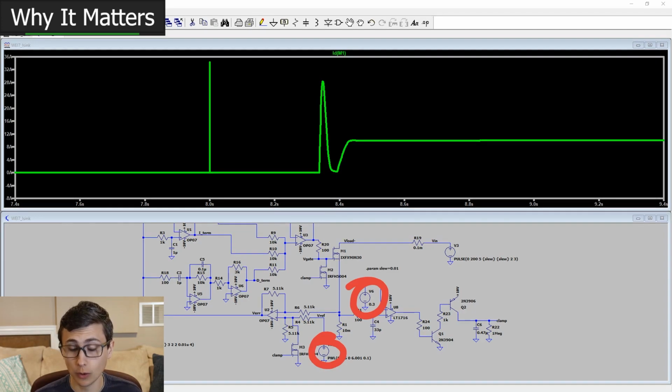There's lots of ways that this could work, and basically you just have an isolation barrier between your communication interfaces and the digital circuitry living in this high voltage region with the plus minus 10 volt stuff. And in theory, as long as you've got some hardware protection for fault conditions, like overvoltage or whatever, we could basically modify the fault current to always keep our MOSFET within the safe operating area limits. And in theory, we could make an unbreakable electronic load where, in all normal cases, the clamp circuit will protect the MOSFET.